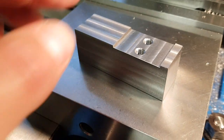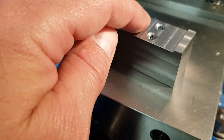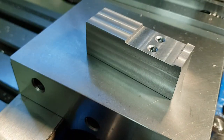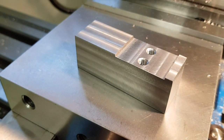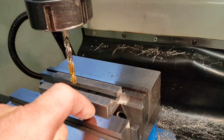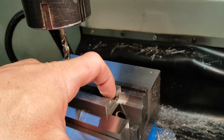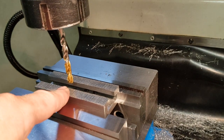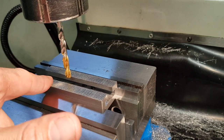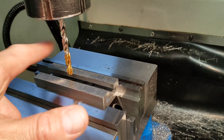I think we need to chamfer the edges of the other piece because it won't go all the way down — there is a very small radius at the bottom. I picked up this edge with the edge finder, used it on both sides and halved it, so zero is in the middle. Then we're going 53.5mm to the first hole, and then 12mm to the next hole. This is the clearance drill for M6.